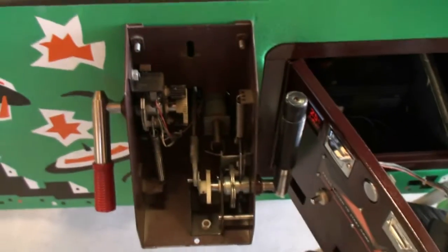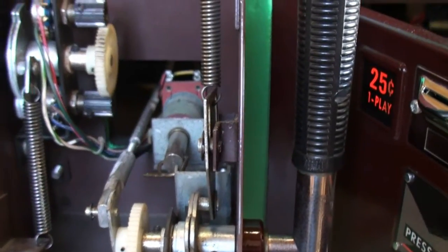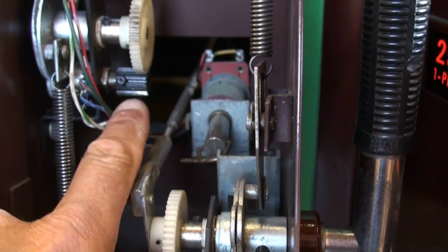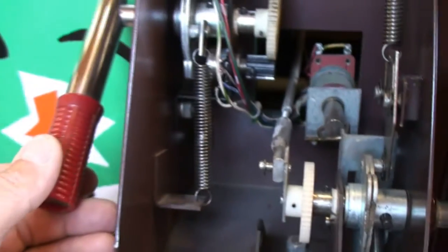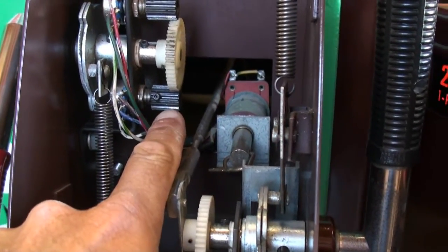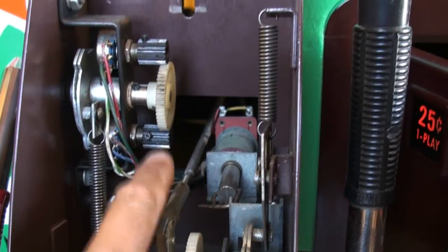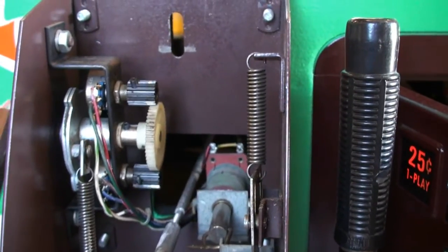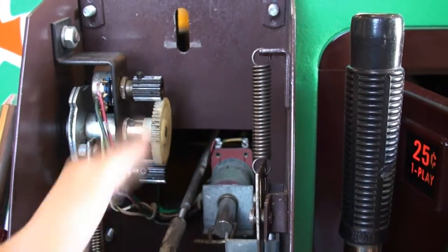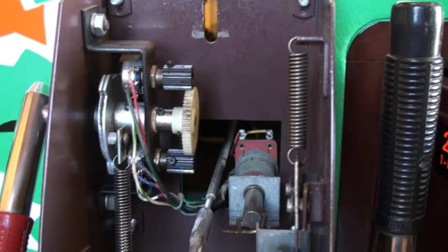And then inside the control panel, there are two potentiometers here on your throttle. And this bottom potentiometer is the second volume control for the helicopter rotor blades. So as you give it more throttle, you rotate this and actually make the helicopter blades volume get louder. And then up here, this is the speed for your helicopter blades. That potentiometer goes to the copter motor board.